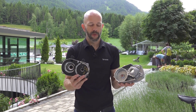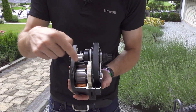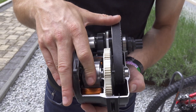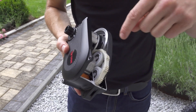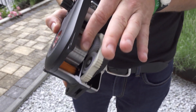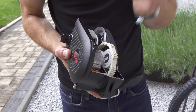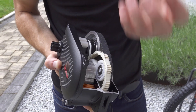We've saved over 500 grams and 25% in size between the aluminum platform and the magnesium platform. This is the actual electrical motor — it consists of magnets and copper windings. We operate around 1,600 to 4,500 RPM in this electrical motor, so we have to bring down that speed with this drive here, which is made out of high-grade composite plastic, so we don't have any metal flakes.